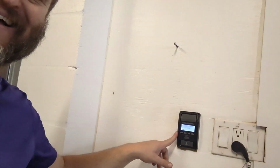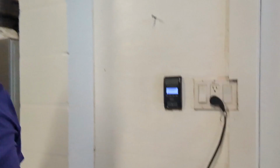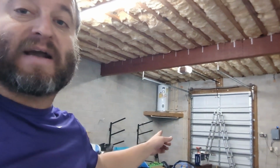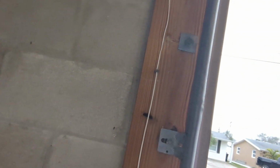Anyway, if you have access to the back of the wall or you can fish the wall, it's a good way to run the wire to make it hidden. So this is ideal installation. We had access back there. For this, no access. Just a piece of wood is going to run the wire. Had to run the wires down anyway for the sensors. So if you look at this garage door, sensor wires are exposed anyway. I can run it right next to the sensor wire over there, and just another wire running through here. Barely notice.